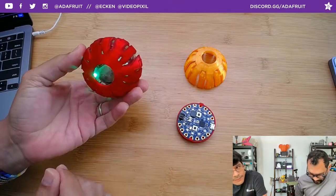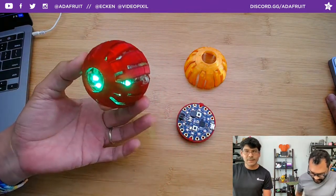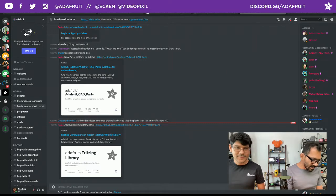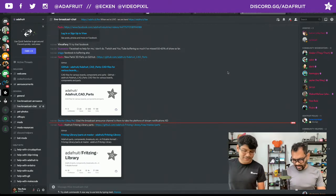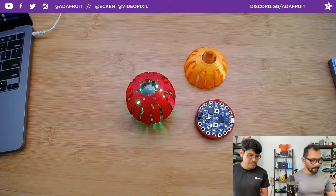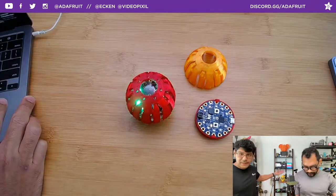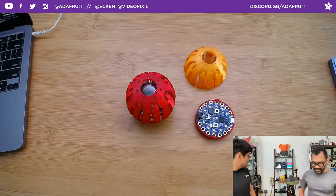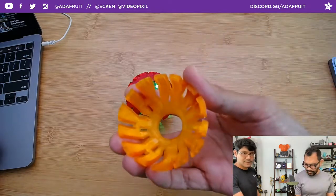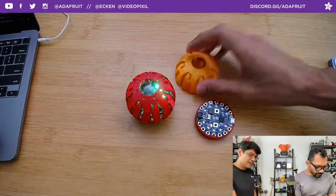Get your Circuit Playground - we used to give it out free but we ran out. For filament suggestions, we're using translucent red from Ultimachine - just regular PLA. If you're going to use PETG, make sure you print it hotter - that's all I can say about that. We like to stick with PLA. The prop here is all PLA too - look how flexible the PETG one is, it just snapped. This one is nice and thick with good rigidity from PLA, but you've got to print PETG at the right temperature for it to be properly annealed.